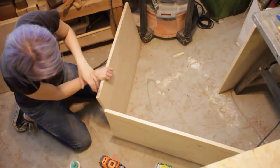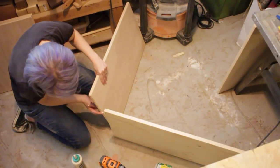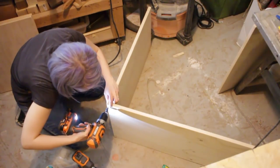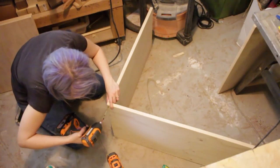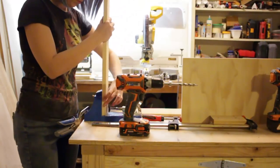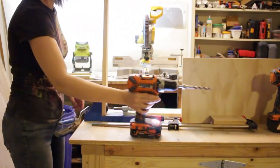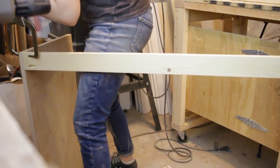While the internal dividers dried, I started to assemble the exterior of the carcass of the box. Since they would be hidden on the underside of the cabinet, I decided to pre-drill and use screws and glue to join the panels together instead of dowels. Since I struggled a little bit with the dowels and don't have very many long clamps, I decided to go back to what I was comfortable with and use pocket hole joinery to join the stretchers connecting the sides of the box.